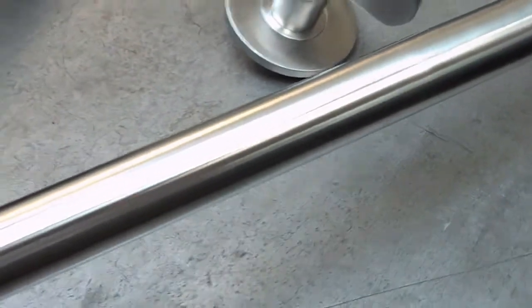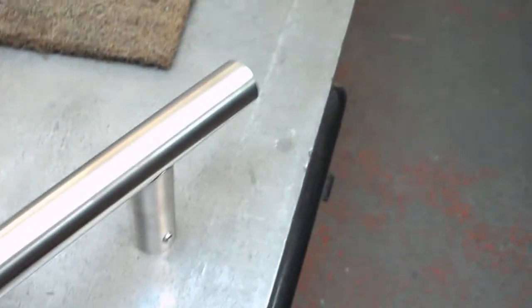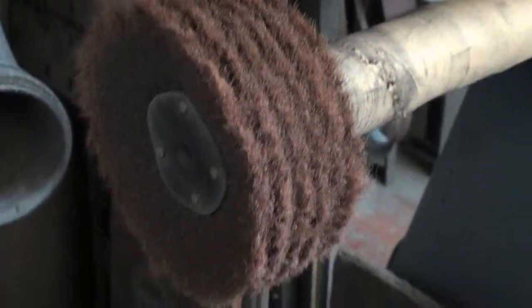The handles we had to take apart — take these stems off — and the actual finish came off reasonably easily with a Scotch-Brite lap mop on the polishing spindle.